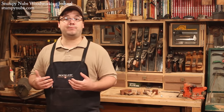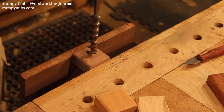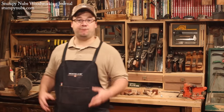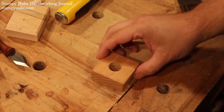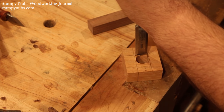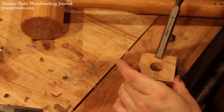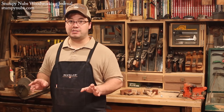The round ones are the same, except I planed flat sides on two half-inch round dowels. Now it's time to cut the mortises. If you're using round beams, you're all set. But for square ones, you have to chisel out some corners. It's always a good idea to chop halfway through one side and then flip it over and do the other half. Take your time — don't try to knock this all out with one strike or you're going to split these.